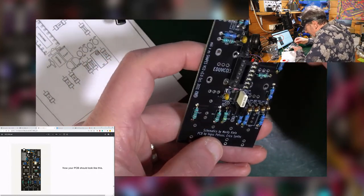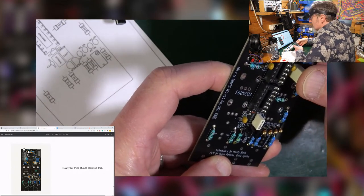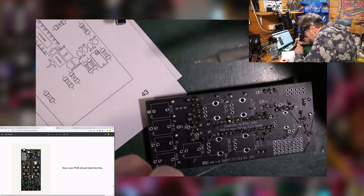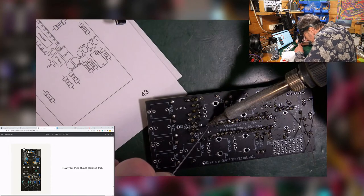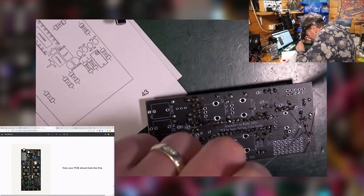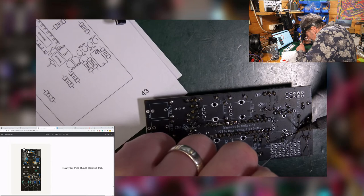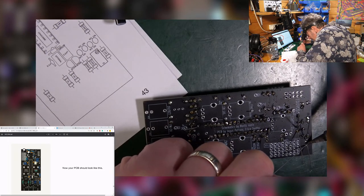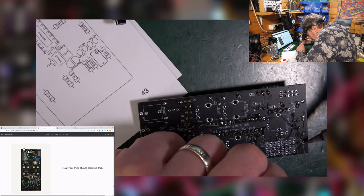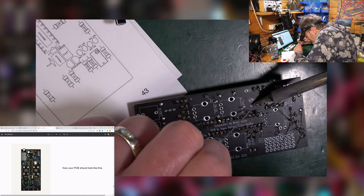The other one is a stubby one, this fella. This goes further up here. 1 microfarad, which is that one. Bend the legs out a little bit spikier in order to push the pins. Then we can solder those. Well, this is coming along now. Sometimes it just doesn't want to flow. Yeah, that's good. This one, go on. Yep. This little one here.